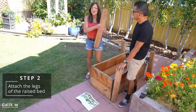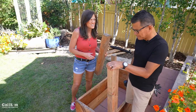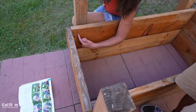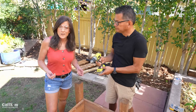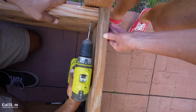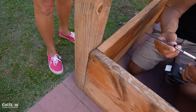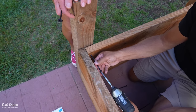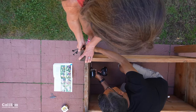For the legs of the raised bed, we're going to use our two and a half foot lengths of four by four posts — these are super sturdy, going to hold up to all the soil you're going to put in your raised bed. First, you're going to pre-drill holes on the inside of your bed — about six holes, three inches apart, up and down the bottom. Now we're going to go ahead and attach the legs. When you're drilling your pilot holes, make sure you use a drill bit that's slightly smaller than your hex screw, then drill the pilot hole all the way through the sides of the raised bed into the post. I'm going to line up the leg here on the outside corner of the raised bed. We're using four-inch hex screws — super sturdy. You need six screws for each leg, spaced about three inches apart, up and down the sides, going all the way through the raised bed into the leg.